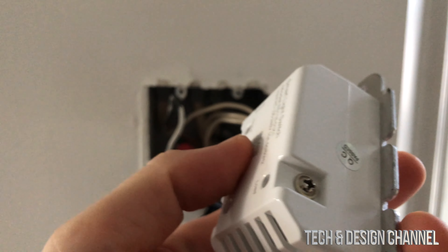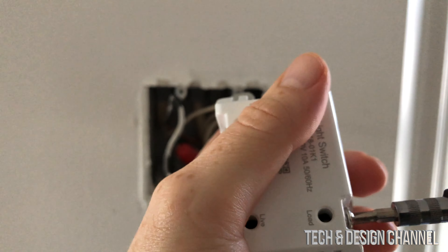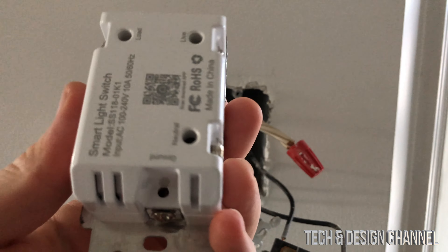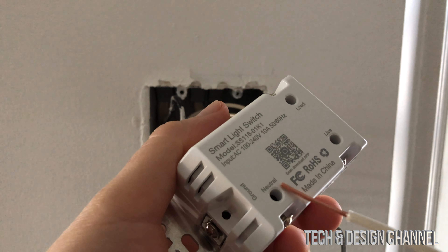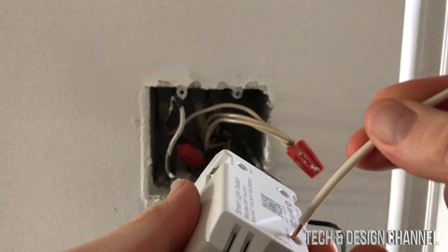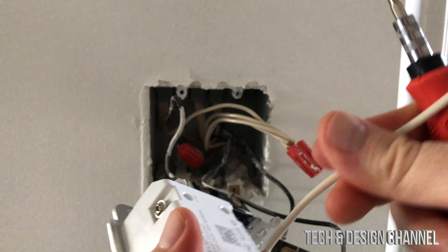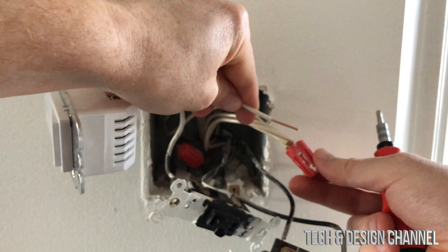As we work on that, we have to get this ready. With a screwdriver we're going to unscrew this a little bit — just make sure it's nice and loose, all the way around. Looking at our diagram, the neutral — which would be our white wire — goes right in here. Once that's in there, then and only then we tighten this up so it stays and won't come out.